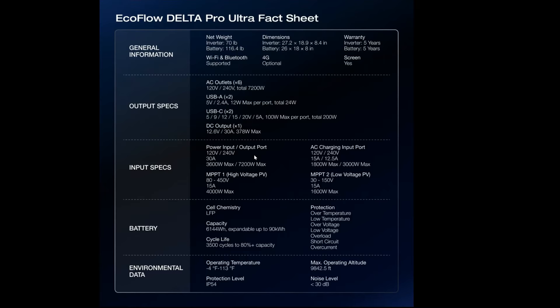Input, though — let's talk about that. This is great. You've got 120V and 240V up to 30 amps, so 3,600 max or 7,200 watts. That's essentially a perfect fit for this power station. I care a lot less personally about the AC inputs — I don't use those nearly as much. If I'm understanding correctly, this would be using the Infinity connection with their new smart home panel to get these kinds of rates. And if you're doing the AC charging input, you're going to get your standard 15 amp 1,800 watt unless you're doing 240 volt, which gets you 3,000 watts.